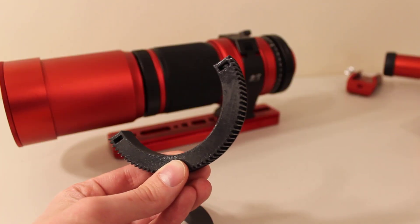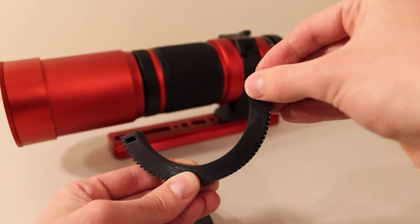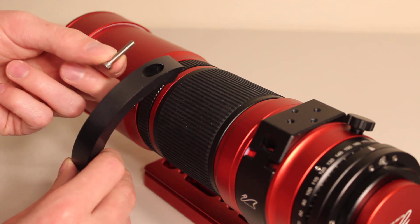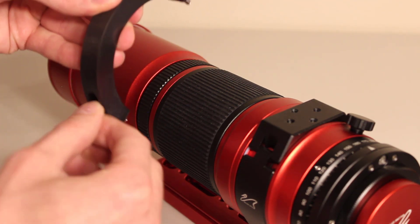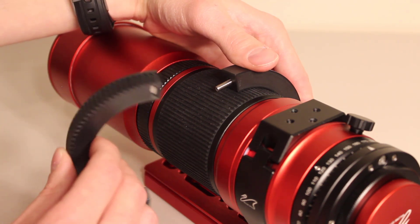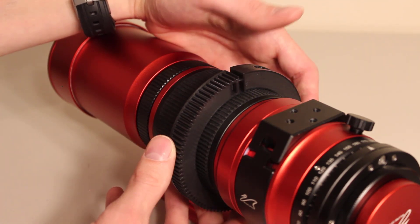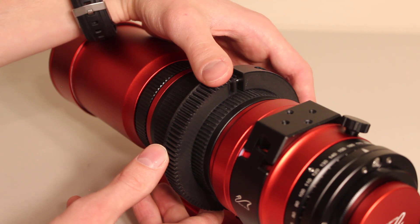The next step is to take the main gear and drop two square nuts into the two holes. They may be a bit tight, so use an Allen wrench to pop them in. Then take the smooth portion of the large gear and drop two 20mm long machine screws into the holes. Slip that over the focuser, then take the geared portion — make sure the wall that sticks out faces the objective end of the scope — and slip that over and do an initial tighten. Don't tighten it too much yet, as you'll need some leeway to adjust once the black cap mount is on.